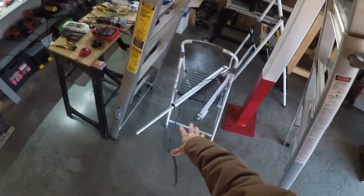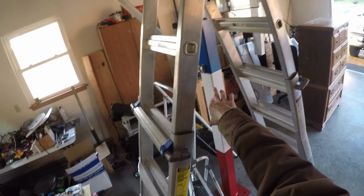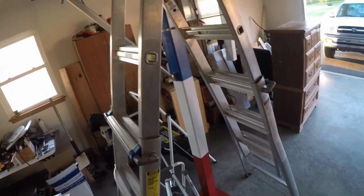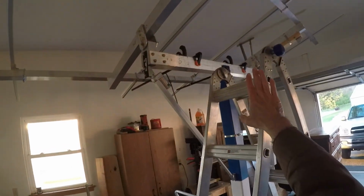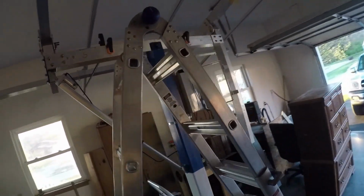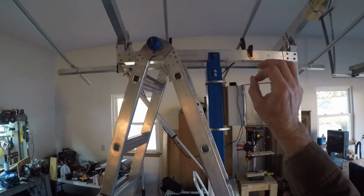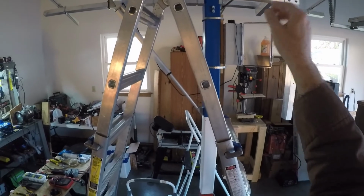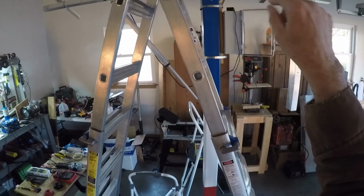It has two actuators. This one is a spare. This other one is a new one. It's got one that's mounted. It took me a little bit to figure it out, but I wound up boring in the tower, which is 4x4 3/16 tubing steel, and a 1/2 inch square foot plate. And then I had the guy cut me a couple ears and drill the holes. I think they're around 3/4 with some holes to mount it. And then it's got a bushing. It's got a brass oil-impregnated bushing that's in the aluminum, so it's a steel pin going through a bushing that fits tightly in the aluminum.